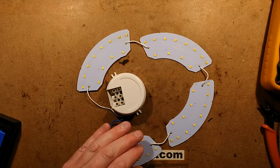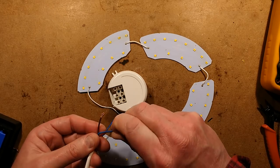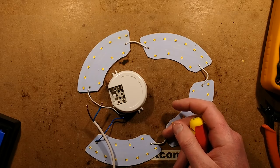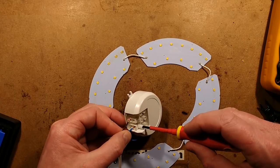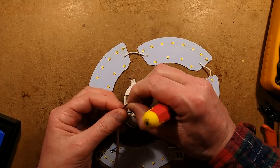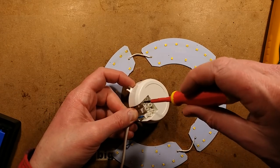The ability to just do little fixes like this is quite useful because it's one of those situations where if one LED goes, it might just have been a rogue LED - particularly in the case of that first one we just looked at. If that's the case then bridging that one out will give it a new lease of life. Another interesting thing: if you had these fittings and they were really failing a lot, you could theoretically make a little modification inside - you could change the sense resistor, increase its value, and that means the output current would be lower. That would be entertaining to do, unless you had a factory batch that were all failing left, right and centre and then you could set up a little production line to fix them.